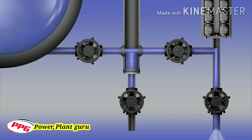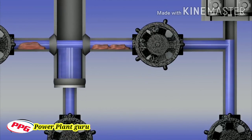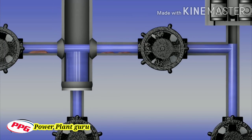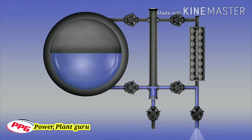This is because the steam and water are both flowing from the outlet of the open drain. By following this procedure, the operator will ensure that steam and water both flow freely in this piping by testing them independently. The intent of this part of the procedure is to remove any debris or sediment from the water leg piping. While the risk of developing a blockage in the steam piping is very low, the risk for sediment buildup in the water piping is much greater over time. After following the blowdown procedure, the operator can be assured the steam and water connecting piping will be thoroughly flushed.